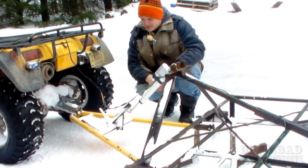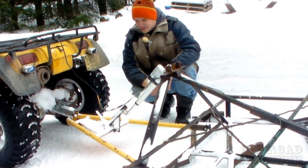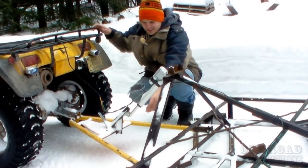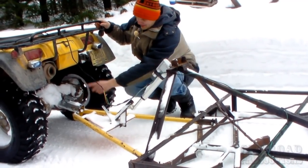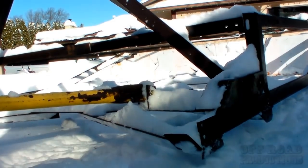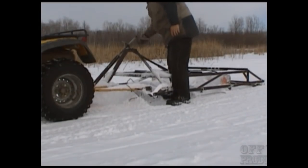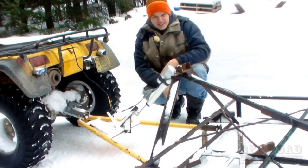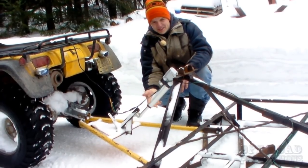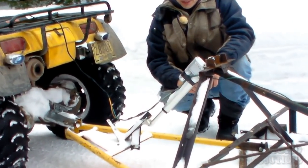This is the most crucial part of the drag. A lot of people just use cables or chain to hook up to the quad, but if you want it to plane across moguls the way a professional drag does, you have to have a solid system like this. That's a regular trailer hitch coupler, and this is an electric actuator to lift the front up and down — lift the blades up and down. On my old video last year you would have seen a hand crank here, which is fine too. Last year I built this on a zero dollar budget. I was always having to get off the quad, crank a little bit, get back on — very annoying. This year I broke the bank and spent a hundred and thirty dollars on this at Princess Auto. If you're from Canada you know what Princess Auto is. It makes the job a lot easier since you can adjust the drag on the fly.